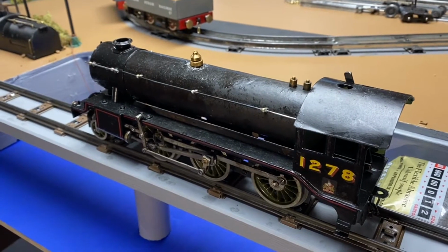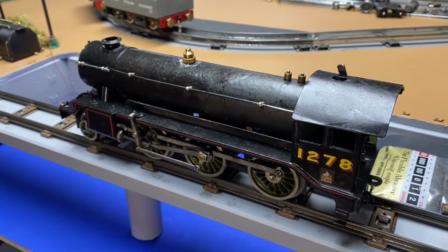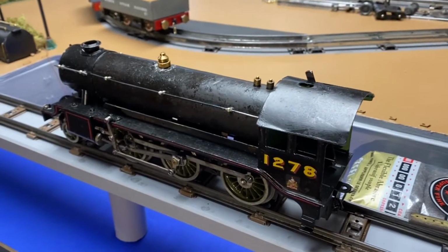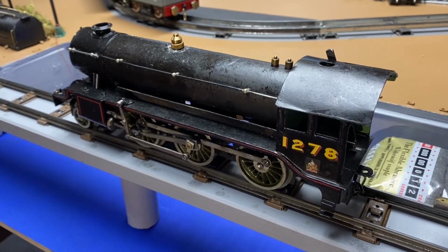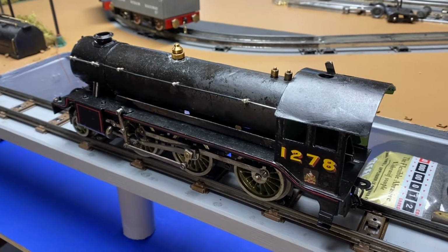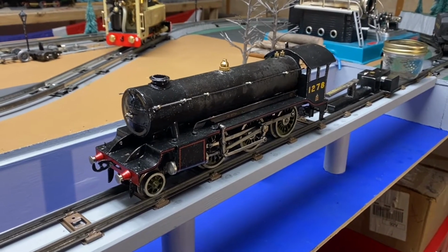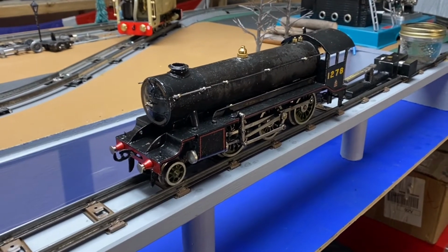So what to put in the boiler? Well, don't use your tap water, even if you live in an area where it's soft water, because there'll be other chemicals in there. There's often chlorine. Sometimes there might be fluoride. There's going to be some amount of minerals. If you live in an area with hard water, don't put that in your boiler. Boilers are copper and things like that, and it will scale it. Also, do not use deionized water. Deionized water often will react in some ways by drawing molecules out of the copper. You don't want to do that either.